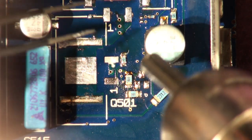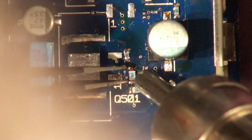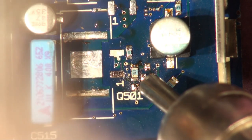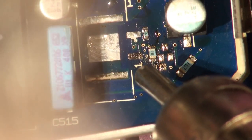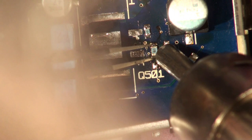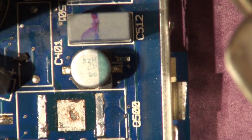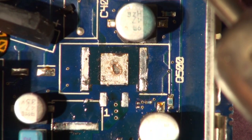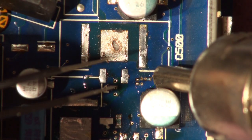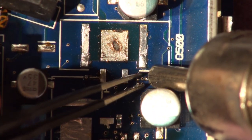There's a diode that's blown over there — it's got stuck on my tweezers now. On this side we've got a 300 ohm resistor, and on the other side we've got the other gate drive resistor, which is open circuit.